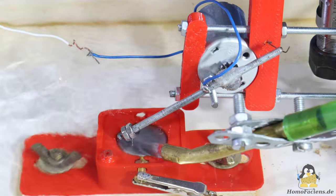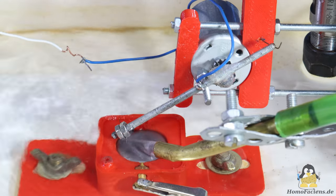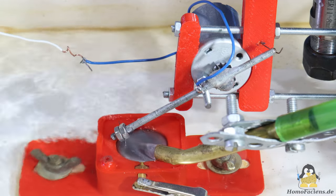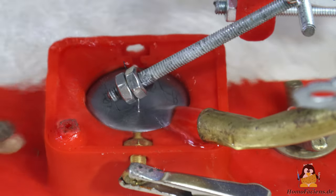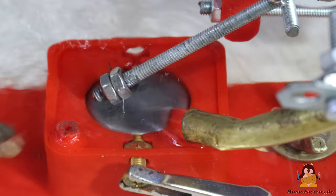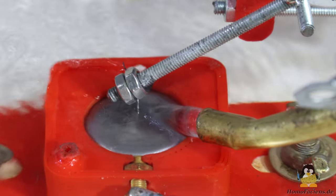As you can see, the DC motor works as a Wagner hammer, here on 12V DC to achieve a current of more than 1 amp. The sparking is a little weaker than I would have expected given the stall current measured, but at least the motor doesn't end up in smoke during the engraving process.